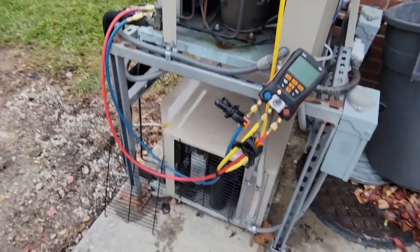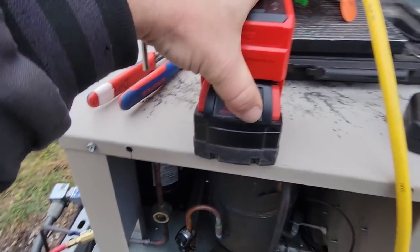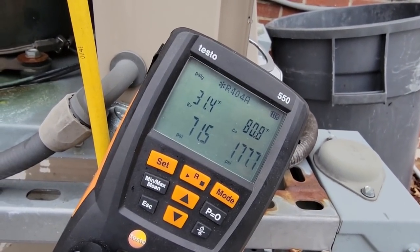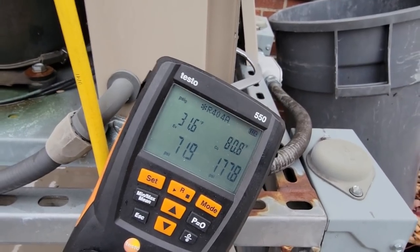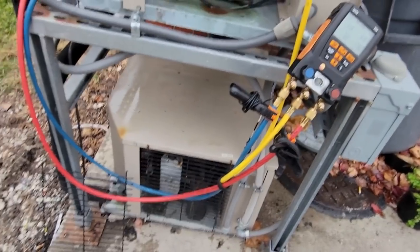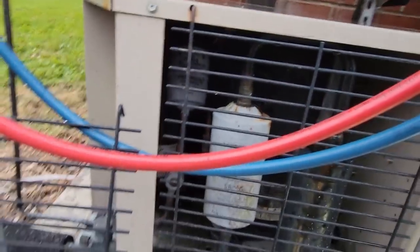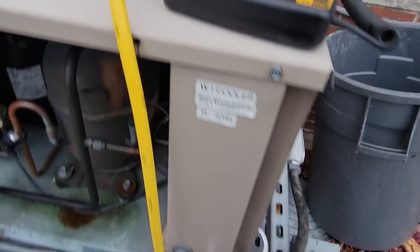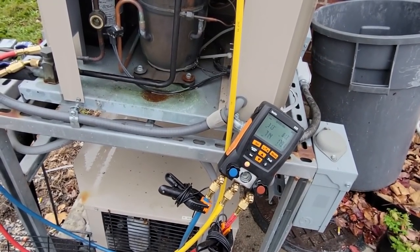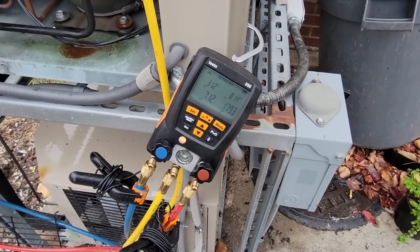This one here is pretty packed full of crud. Let's go ahead and get this thing back up and running and see how it does. This is a little dinky 5-amp battery on this one — it didn't even run it down. Readings are looking a little better — 318, 320. We're solid on this one down here. You can see through that coil now back here. Let's say two and a half pounds low — let's do a shot at it with the leak detector. I think this thing has a very small leak and has had a tendency to be a little low every so often. Head pressure is staying at a more reasonable level, around 180, which is where that head master head pressure control valve is set — hidden back here in the back corner.